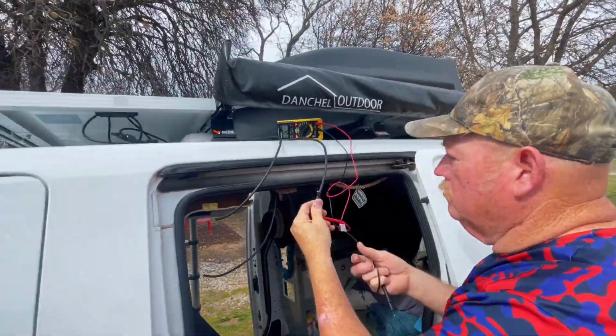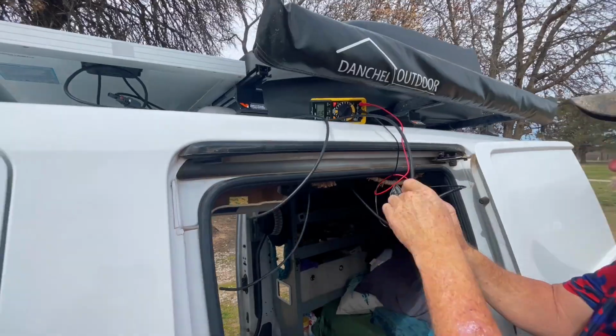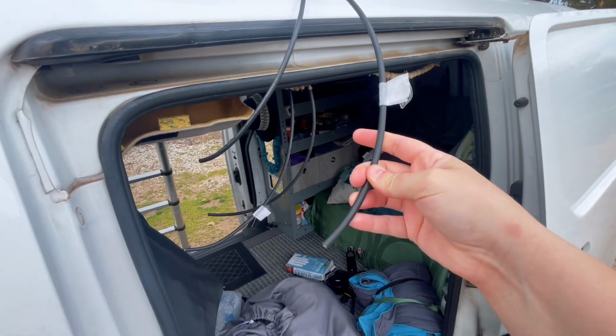You can purchase all these components together from a solar company, but since I had the panel already, and that's all I had, we're piecing it together, one piece at a time. Dad just did the continuity test by holding those pieces to each of the wires, and you find the one that the signal comes through by the beep.